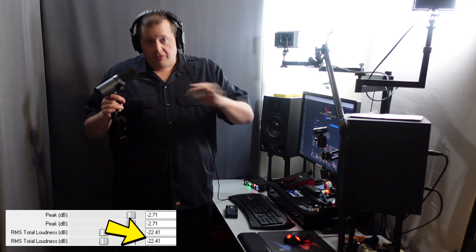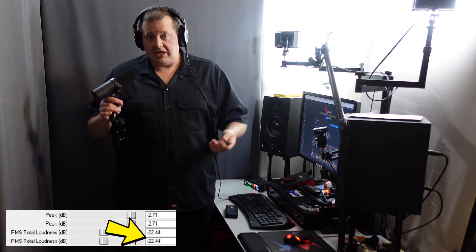I don't need to scan everything, but what I'm going to do now is take the cable over to it. Like I said, I'm going to go for broke — I'm going to disconnect the SM7B and connect up one of my 150-ohm XLR dummy loads, so that if there is any noise at all you're going to hear it. It'll probably be extremely low in volume, so I'll be boosting it up in post so you can actually hear the noise. On screen I'll show you the noise floor level in real time as I take it around. You won't hear me talk during the test, but feel free to turn up the volume to hear it.